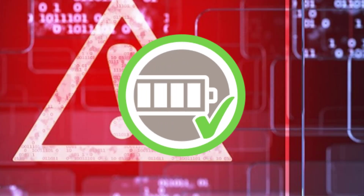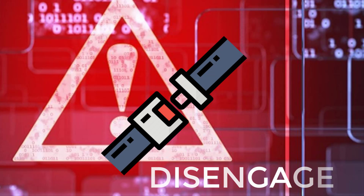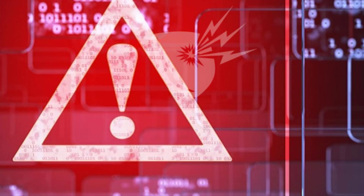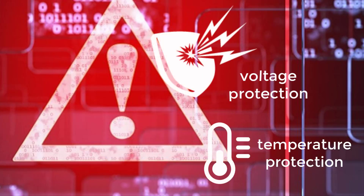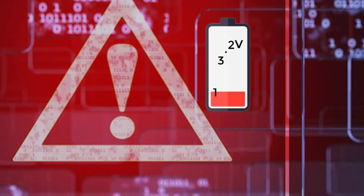Your system will always be safe with this battery combiner, as it will disengage immediately when the cell is signaling overvoltage — this includes temperature protection too. In case where the battery voltage drops below 13.2 volts, the combiner will also disengage.